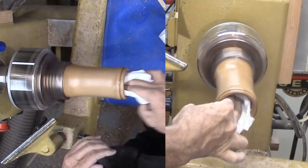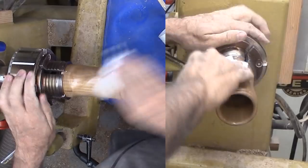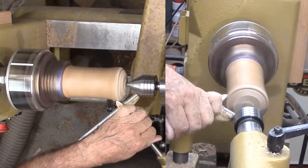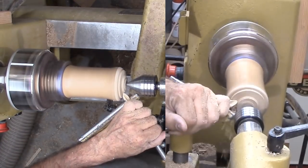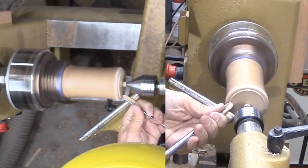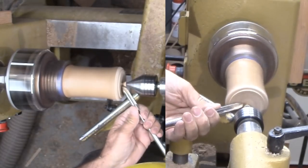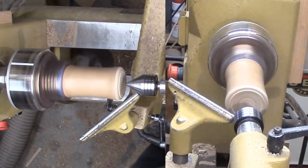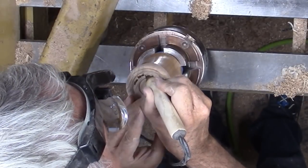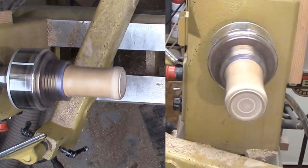Then I applied lacquer to the entire project. I like finishing as I go and using finishes that I can easily blend together. However, I don't like the lacquer I'm using — I need to find some of the old stuff I used to use. Now I'm reversing the wood; masking tape is protecting the upper surface. Now I can trim back the bottom to sit well on a surface, using a spindle gouge with very light cuts, undercutting the live center but not severing it until the last possible moment. After sanding but before removing it from the chuck, I'll sign with my wood burning setup, then sand again to remove any scorching before applying lacquer to the bottom.